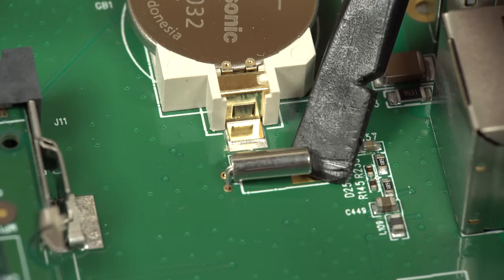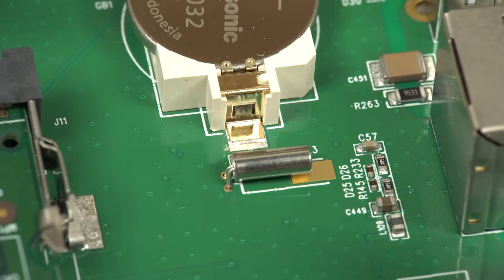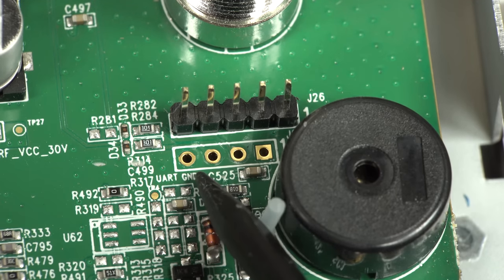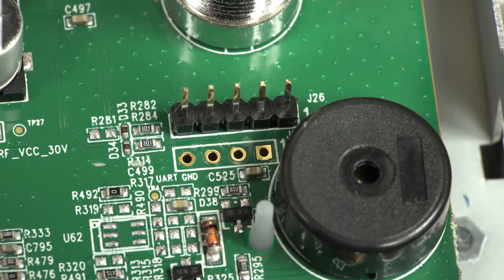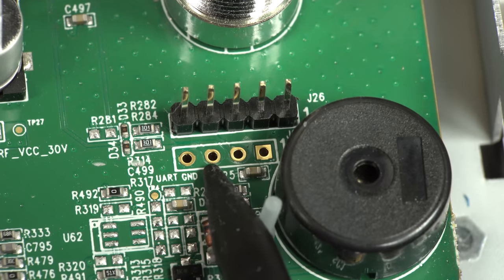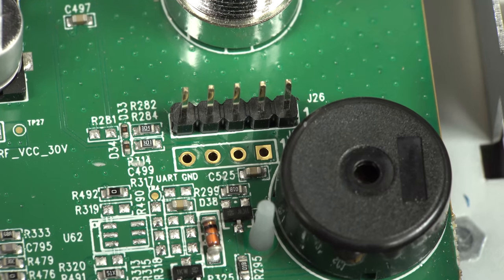You can't leave your poor little watch crystal flapping around in the breeze like that - that's what the pad's there for! Solder it down! There we go - we're going to have our transmit, receive, and ground in there. Five pin header - that's some sort of programming interface probably. We can get in there and tap off the bootloader. We've just got our serial interface adapter - ground is pin 1, and pin 3 is the 115K baud serial output.